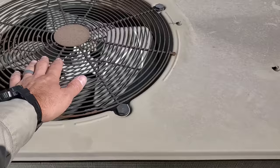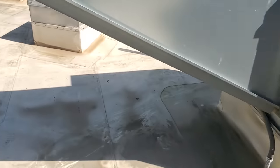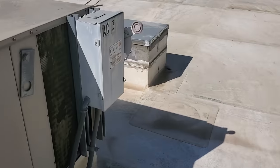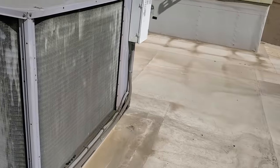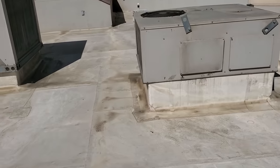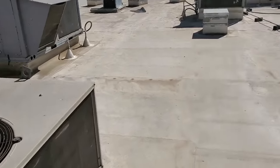This one's not warm air coming out. Dirty condensers. We got our work cut out for us. These are old Lennox units too. It's all warm air, but that one's left off at the disconnect switch - that's a main dining AC, so that could be a problem. This one's not running, we'll have to dig into that. Well, at this point we'll just start picking them one by one, start back there at the back and work our way through.